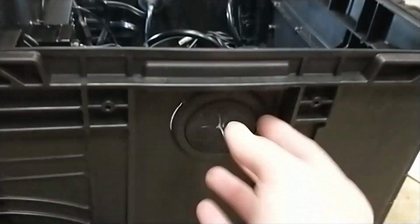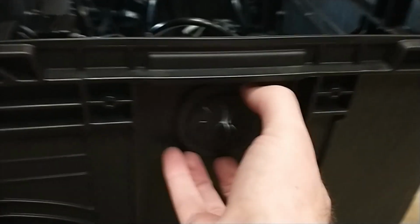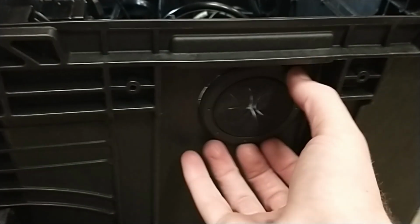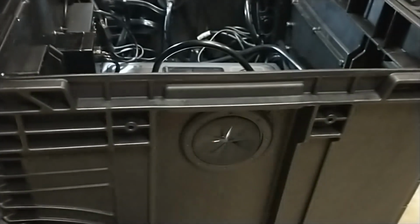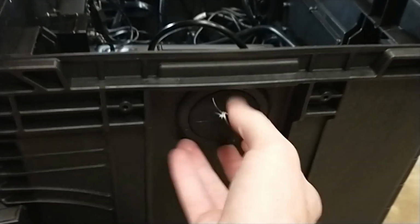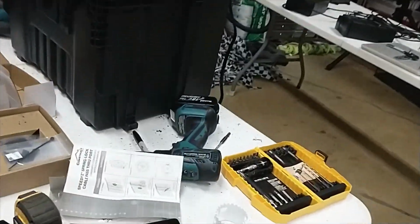And what you'll find is you can actually see a little light coming through right here. Now it's not going to come out. This is 2 3/4 inch wide or round, and so it's not going to come out. But I'm going to try to go with a 2 1/4 inch hole, even if I have to slightly shave around it to where it fits in there perfect. But I don't really like that it's that loose. This is exactly what it calls for, though, so I didn't do anything wrong. But just so you know, if you get this exact same thing, then you may want to try to go 2 1/4. So I'm going to try that first.